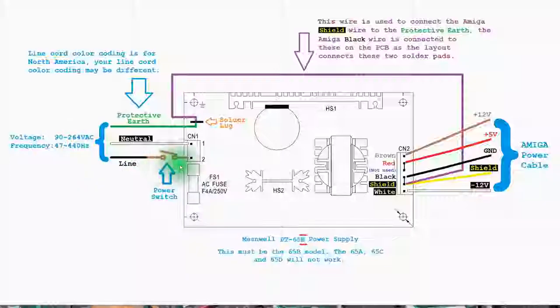The switch I used was reused from the original Amiga European power supply. The original mod had me put a yellow jumper wire on the back of the board, and I really disliked what I did — I think that was a potential safety issue. If you drop it and the wire breaks loose, it could cause problems.